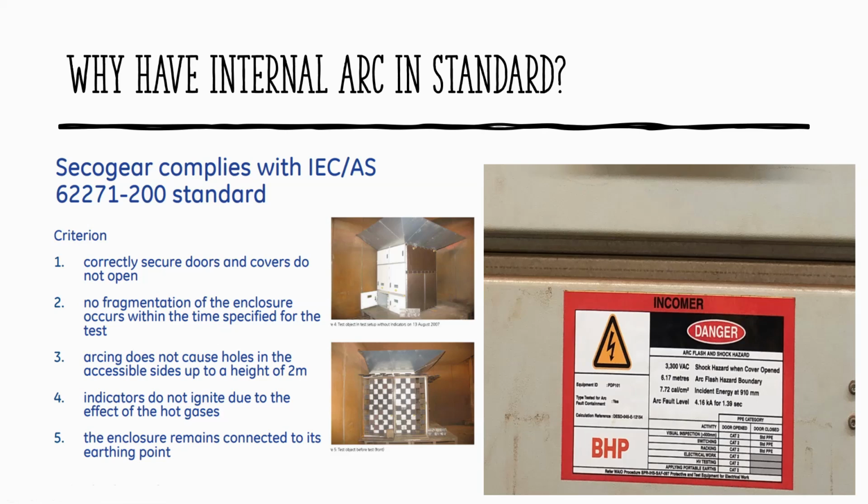So sometimes I'm just thinking, really, did you really read the nameplate? That's fine, because that's the site policy. We cannot bend that one, even though we know when we read the nameplate of the board that it has an arc plus classification, internal arc plus classification, 25 kA. And those people are wearing bomb suits and everything when the available fault is only 4.1 kA. But still, site policy needs to be followed. We have to respect that one.